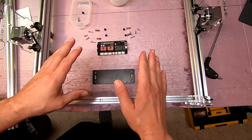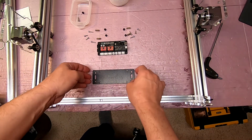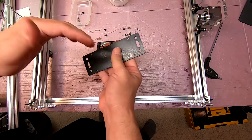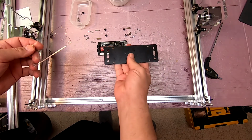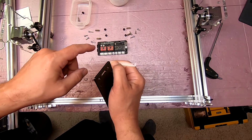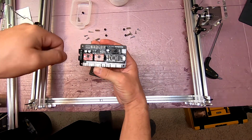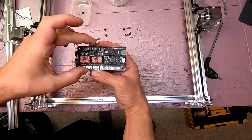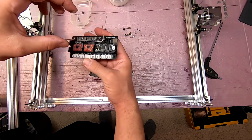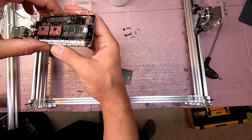So at this point, I'm putting in the PCB board. You have two plastic pieces, at least in this kit. I've seen photos that have differently shaped pieces. This is the base. This is the top. You want to orient this so that the large cutout at the end is over this piece right here, allowing for the vertical connection, and the hole is over this push switch. Okay, and so there's no other way that can work.